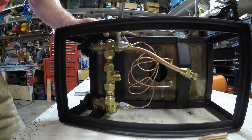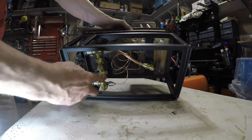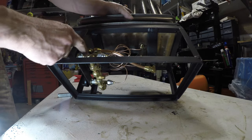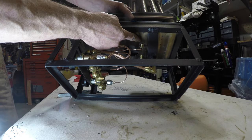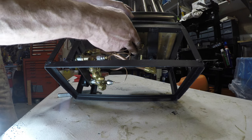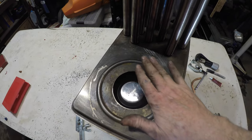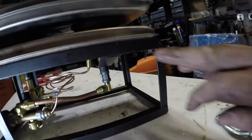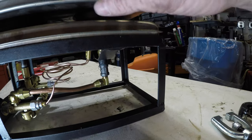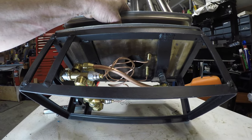We've got both valves to turn it on — that gets the gas flowing here, then it goes to the valves. It's got thermocouplers that go up next to the burner and have to be hot to let gas flow through. I put them both on the same burner. Here's the burner — it's solid. I've got one burner here; I'm going to put a plate over the top so I can put a pan on there and boil water. The other burner is in the lower chamber, which is baffled so it has to come up through here. I've cut a hole in the bottom because it's going to need oxygen going in.